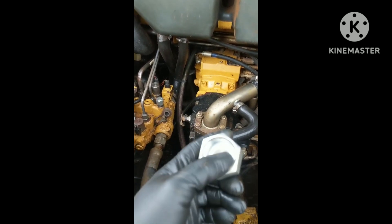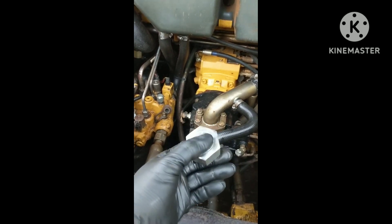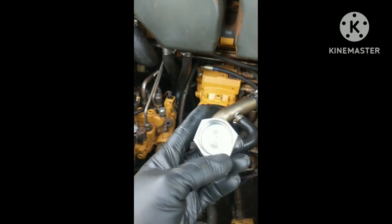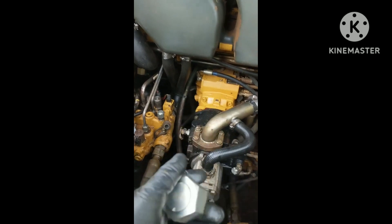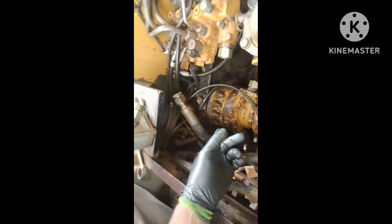See these caps here — it's safe if you're taking a function off a machine. They're really good because the plunger is kind of encapsulated with the cap itself, so when you put pressure to it you don't have to worry about these leaking. This is actually an O-ring face seal too, so you also have the O-ring that sits against that flat surface, which is really going to help it seal as well. I've got just about everything taken care of here to pull this drive motor out. All my lines are off — the only thing I've got left is four nuts to take off here and four at the bottom. The ones at the bottom can be a little bit of a bugger to get to just because you don't have a lot of clearance to them.